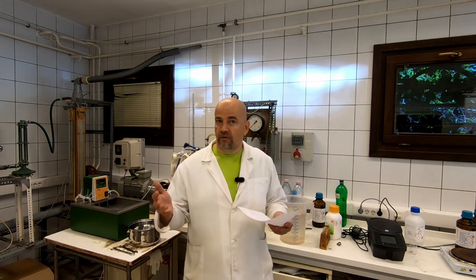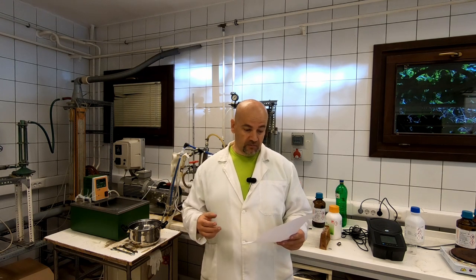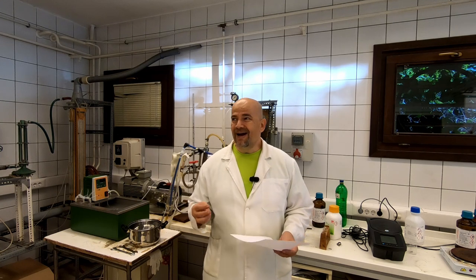The conclusions. Well, this antibacterial filament really works compared to regular PLA, so those built-in metal ion complexes block the metabolic processes of the bacteria. But as you saw, from a food safety aspect, they are not perfect. For example, for me at home, I wouldn't use it to 3D print some object which has direct contact with food. Of course, it depends what kind of food and how long you want to keep it.